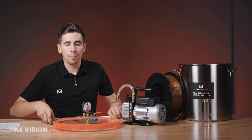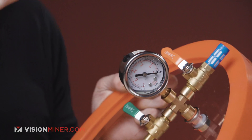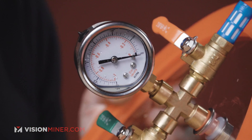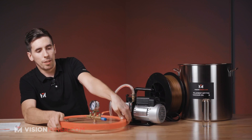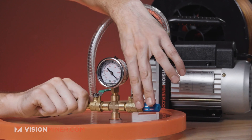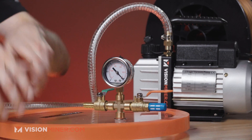One thing you need to do with this valve before you actually pull vacuum is cut this little tiny tip off — that allows a little bit of airflow. You'll notice these don't come filled, but you can fill them with glycerin or vacuum oil; it's not really necessary but it is something you can do. When it's under vacuum and you open it back up, make sure to open the side with the particle filter. It'll fill back up with air and then the lid will release.